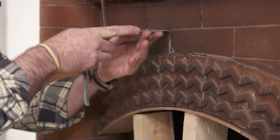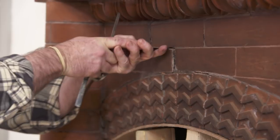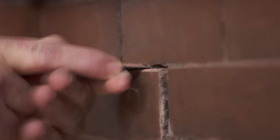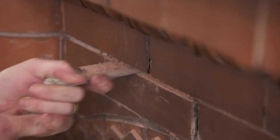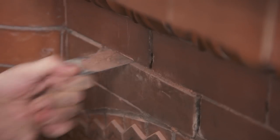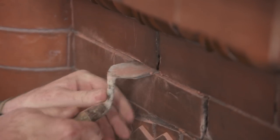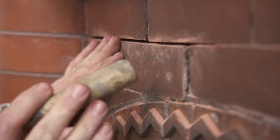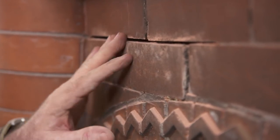In terms of my tools, I'm going to go a little unconventional. These are just margin trowels and flat joiners, but they're the only thing thin enough for me to actually get in and extract the mortar. The conventional tool would be a chisel, but the chisel has a wide head and that'll chip the brick — the opposite of what we're trying to do. So now I'm just going to tap this brick up and hopefully break that bond right there and be able to slip the brick out.